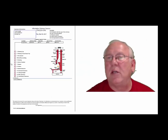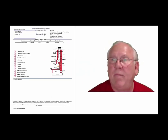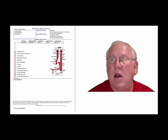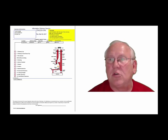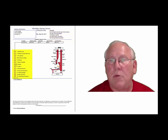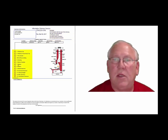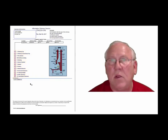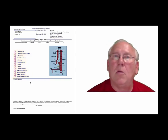Let's take a look at the inspection report and see how it reads. This is a generic report — this is exactly what you will get, only your information will be filled into the blanks. In the upper right-hand corner is the legend. Each initial pertains to something: A is consistent with the age of the chimney, B is comments below, C is repairs needed, D is need further evaluation, and E is not applicable. They're placed into boxes next to the parts of the chimney identified in the diagram, and you'll find my comments below.